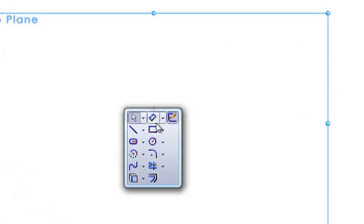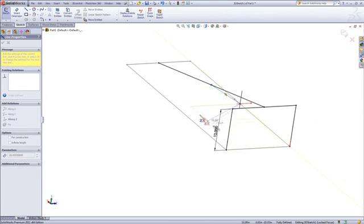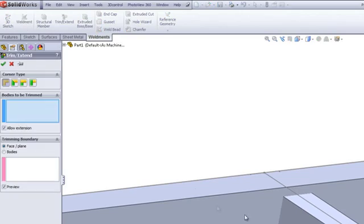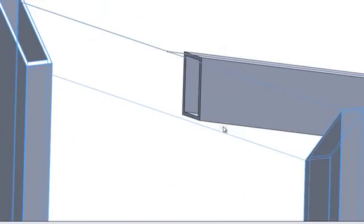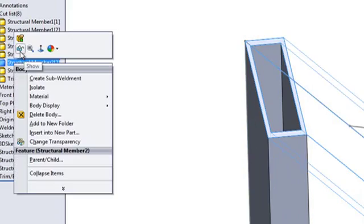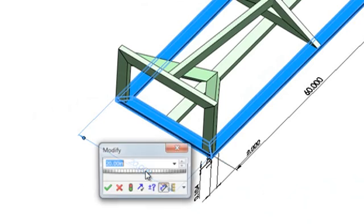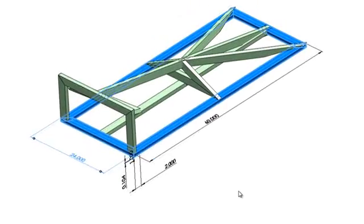When working with the weldment features inside SOLIDWORKS, 3D sketching really helps speed up the design process, especially when it comes time to make changes. We're going to build the base of the chassis from scratch. I can get an exact representation of the parts in 3D to visualize how things will look, fit, and behave. There are a lot of components you're going to bolt to this chassis, so fitment and clearances are crucial. The biggest benefit is we won't have to pay our fabrication guide twice. If I want to change the overall width from 20 inches to 24 inches, all I have to do is make one change to the dimension and everything else updates. No errors and it's super fast.